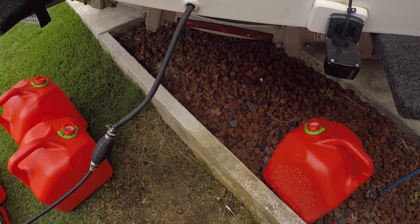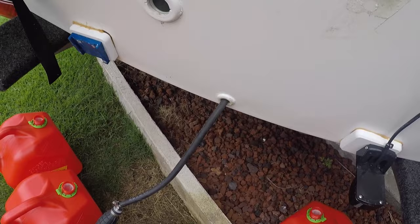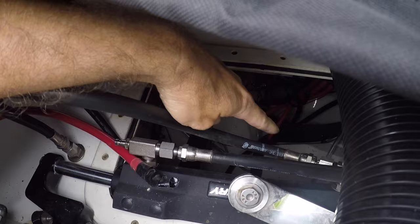When I first set this up, I tried routing the fuel line out of my rigging hose and pumping it down from there, but the problem was that inside my hatch the fuel line dipped down and then came back up, which would create an airlock. So the issue is you have to make sure your continuous line has no dips. Wherever it comes out of the tank, keep it at that same level and then let it go lower — as long as it stays lower than the tank level, you're good, even if the line is long.